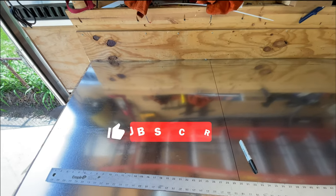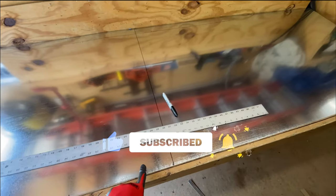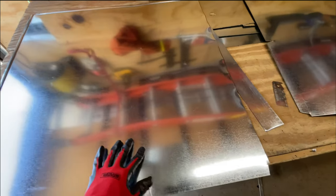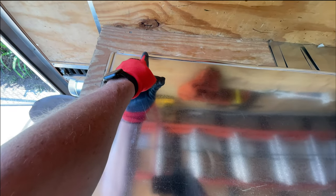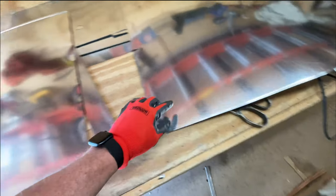All right, I'm working on the metal. This is my plenum. I'm laying this out, get that cut out. So on my plenums that I make, basically you lay it out the dimensions of what your furnace or coil is. You do your quarter inch. This is your double hem seam. Then on the top, I do the Pittsburgh. And then obviously the Pittsburgh on the side, because this side of the quarter will go inside this one.